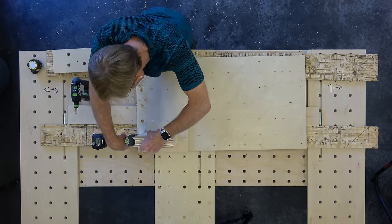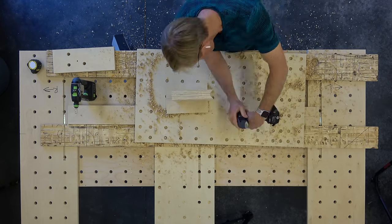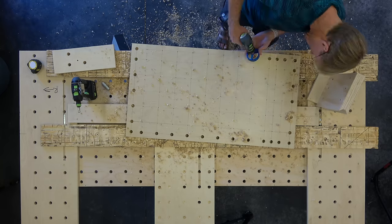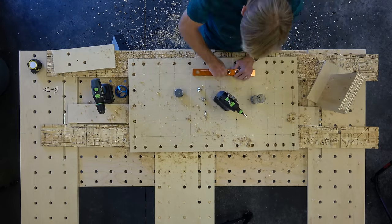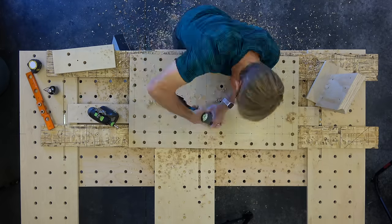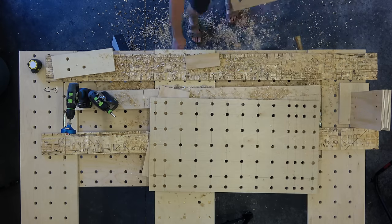Then I used a drill bit to drill the pilot hole, and used a shop-made jig to get the holes fairly plumb. On the backside, the first thing I did was drill the 20 millimeter holes not all the way through — just the ones to make the backside clean — and I used my jig for all of these. I flipped it over, did a few holes with the shop-made jig, then switched over to my favorite method with the drill guide I had purchased. Then I got out the PARF guide Mark II — I wanted to do a handful of holes using the pins in the holes I had drilled to confirm I was getting the accuracy I would have gotten with the Mark II. Everything laid out and I was pretty happy with that, so I put it away and went back to using the purchased drill guide.